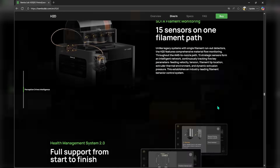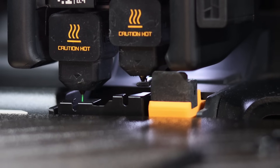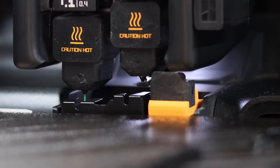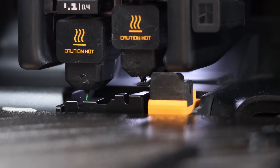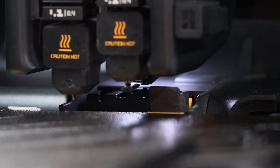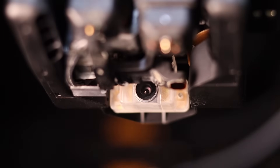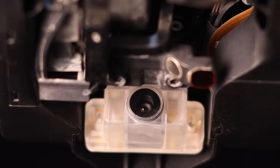What's interesting is that it doesn't actually extrude filament onto any surface on the build plate to do the measurements. Instead, it does an extrusion over the poop chute and that's it. Will it be absolute perfection? I don't see that being possible — there are too many factors involved — but I think it might be good enough to do the job automatically so tolerances are tight and printed parts fit together properly. This printer also has a nozzle camera, but from what I've read, it's not being used for calibration — it's being used for defect detection instead.